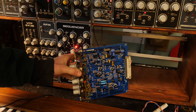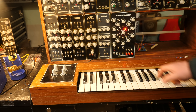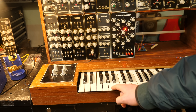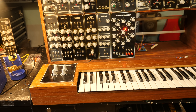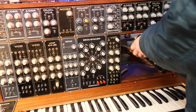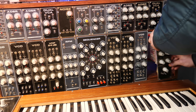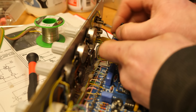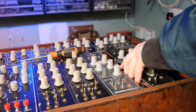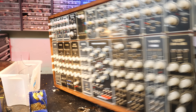The oscillators all needed a little bit of calibrating but surprisingly not much at all — they were already pretty in tune out of the box. We're not done yet though; we've got to finish the rest of the synthesizer and put more modules in on this side. I went for exactly the same style of synth voice over here so we've got two of them making different sounds at the same time. There were a few problems — I needed to swap a broken switch — then after wiring all the same connections to the back on this side, we can test these.